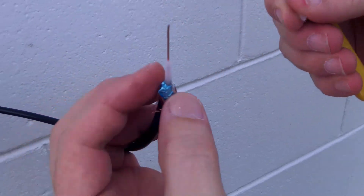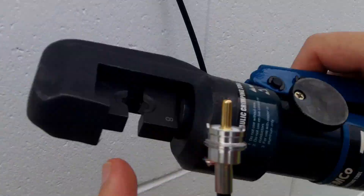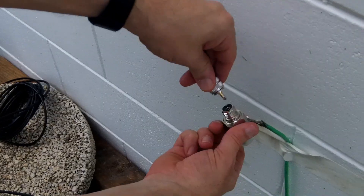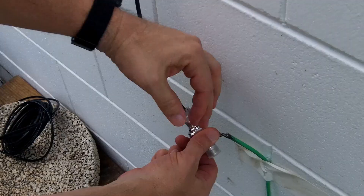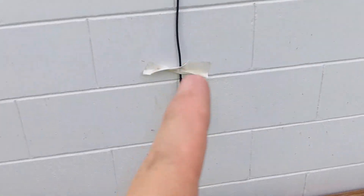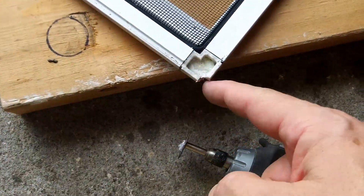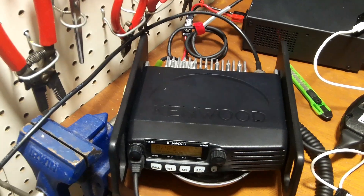Put this in, ran the wire, clamped things on, did a little crimping, and then I'm terminating my coaxial cable at the right lengths. I bought a kind of 50-foot pre-terminated roll, and I'm putting two connectors on — one here to go into the lightning arrester, then I screw the other end of the cable in, drill a hole, put the cable through the hole without a connector so I'd have a small hole, notch the window screen a little bit to get things in, and then put a connector on on the inside and hook that up to my radio.